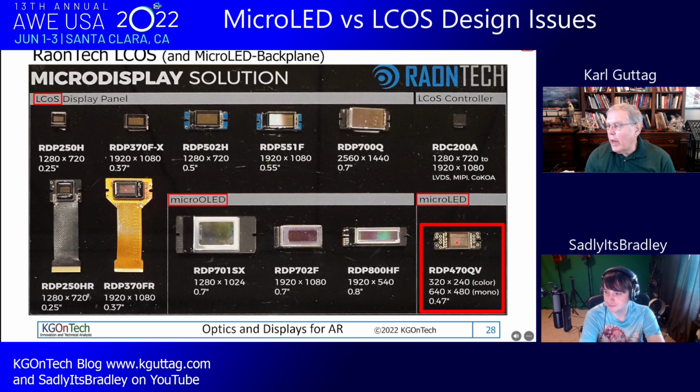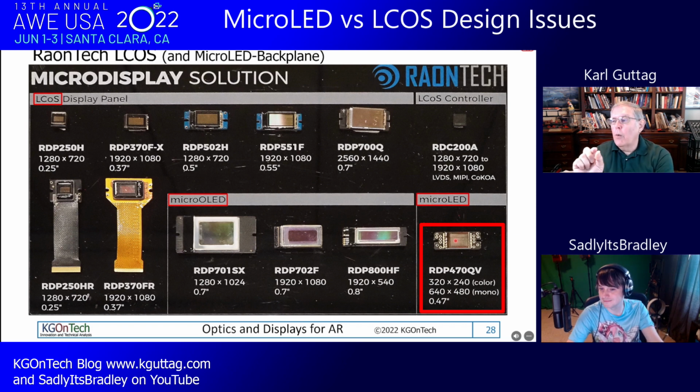When you start to go here, a lot of people have started by taking LCOS designs that weren't really designed to drive current, and they could build kind of dim micro-LEDs to proof of concept. But eventually, you have to build a more complicated structure, because an LCOS is dead simple. You put a static voltage. There's no current to speak of. There's only current when you change the pixel value. So when you go to micro-LEDs, instead of 1 transistor, or in our case sometimes 6 to build a static RAM bit, you now have to have a current drive structure.